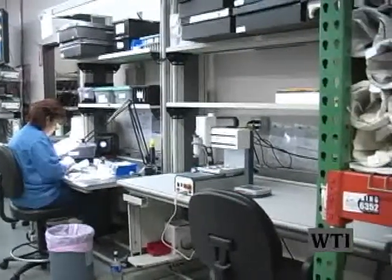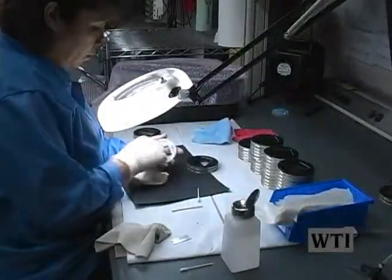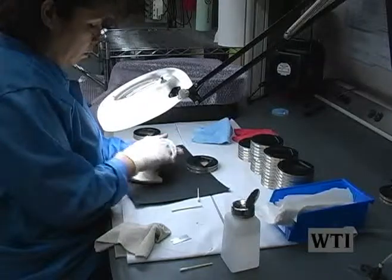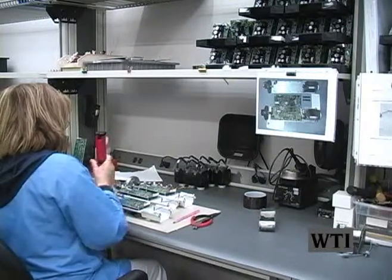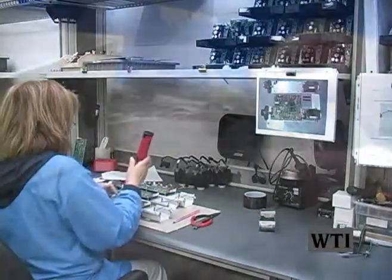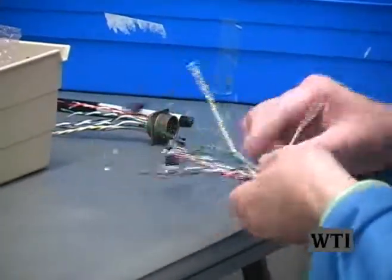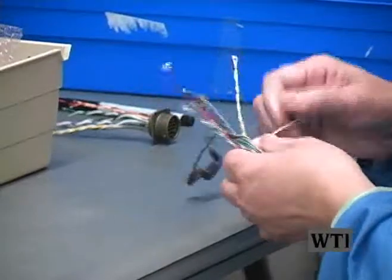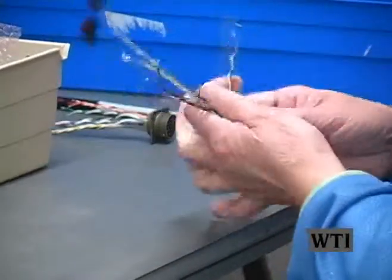Manufacturing work and quality assurance testing in progress. Each of the power modem, power supply, and heater PCBs has a 100% inspection performed after manufacturing and cleaning. Any piece found to be non-conforming is corrected by the personnel who made the specific part. A sample of each lot of back plate and lens plate is water tested for leaks before assembly into the cameras.